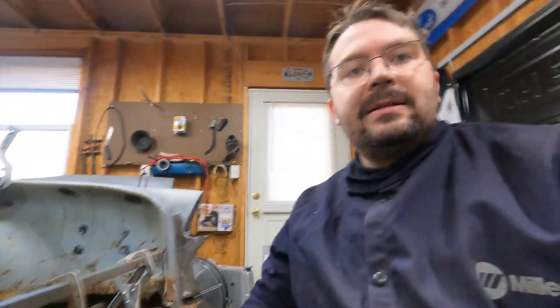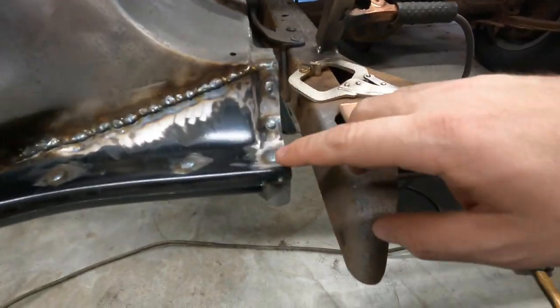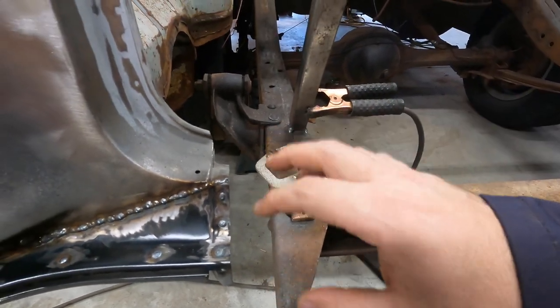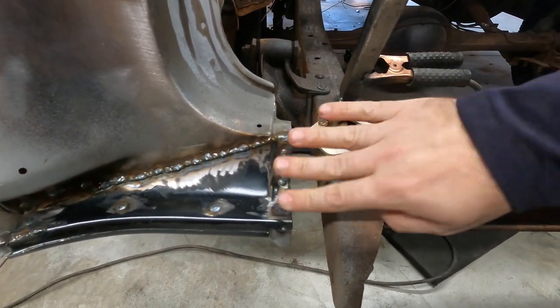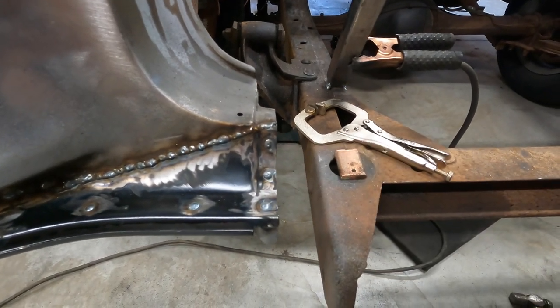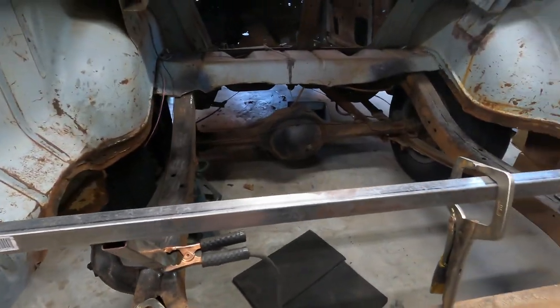I'll be doing the same exact thing on the right hand side, so I'm not gonna set it up and show all that. It's the same exact thing. And then whenever I get that side done, then I'll grind down these little rosettes and do the same thing for that sill panel that I did for putting this one on, drilling the holes and doing those rosettes onto this spot because it overlaps just like this one did. And then yeah, my next video coming up should be putting the floor in.